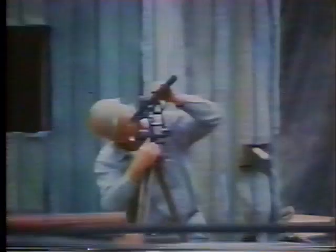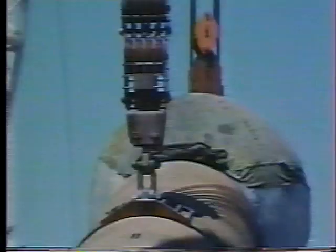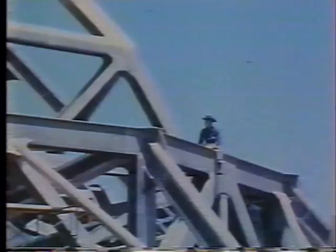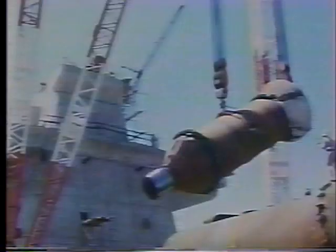The assembled shaft and sphere were the first to be rigged to go in the air. A problem with lifting the sphere and shaft into place was to locate the pick points so that at the final rest angle of 38 degrees and 27 minutes, neither derrick would be overloaded. The weight of the unit is 386 tons. Its center of gravity was located and pick points were set so that at no lift angle would either derrick be overloaded — no miscalculations allowable here.